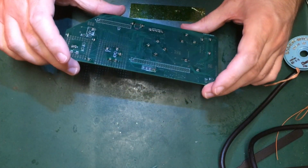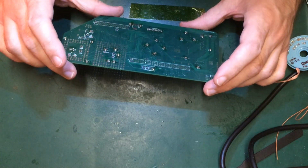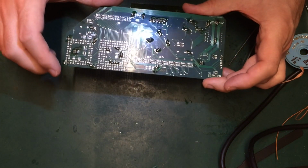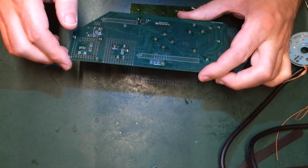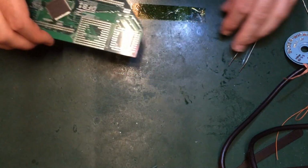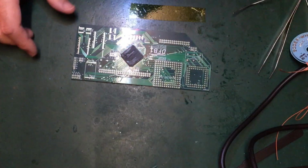And we've got some optionals on the, well, not optionals, but tuning resistors on the front. So we've still got our networks. We've got 1, 2, 3, 4, 5, 6 resistor networks. I'm not actually sure I've got any of those. Those are 4x10K, and they're used primarily for doing pull-ups.